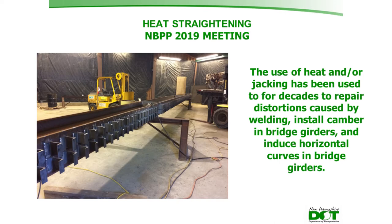The photo shown is a girder purchased for a deck superstructure replacement. They ordered the steel with a certain camber, then welded shear connectors and clips for diaphragms. That induced what is referred to in engineering circles as a 'whoop' in the girder, and heat straightening techniques were used to try to straighten it out prior to setting it in place.